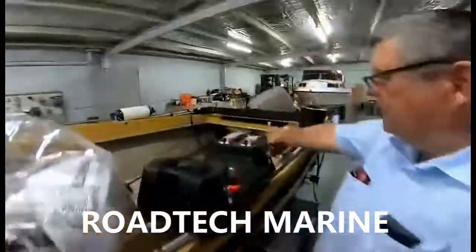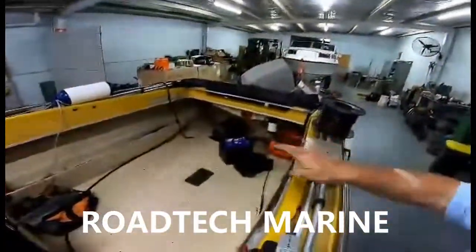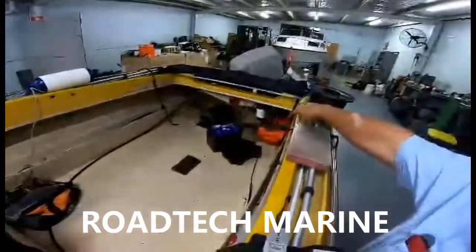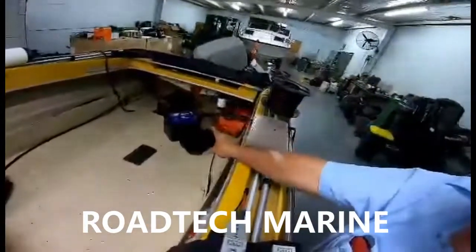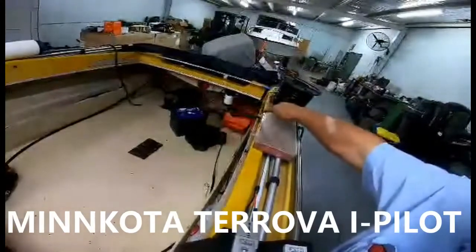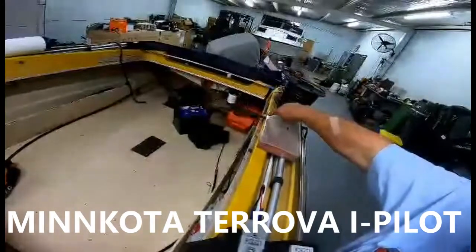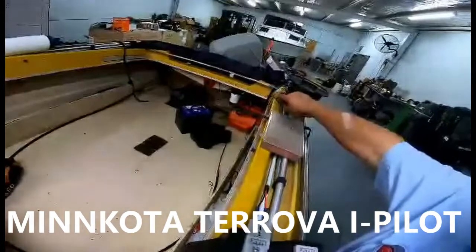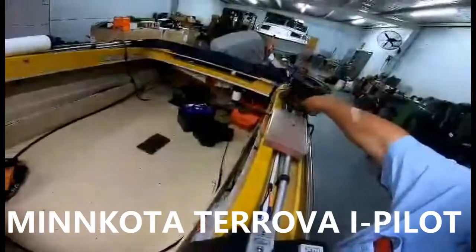You've got the one battery there, which is your primary boat battery, which starts your motor and all that. There'll be an auxiliary, what we call a second battery or auxiliary battery there, so that if anything fails on that, you can use the big red switch there to switch back. You can either join the two batteries or isolate and drop across to this battery here and use that as your battery. We've also got that battery management or isolator which will go in.